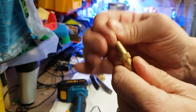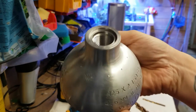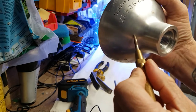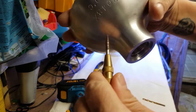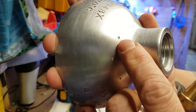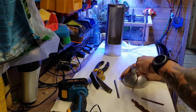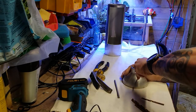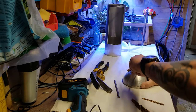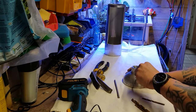A little punching device here — as you push it down I'll show you. I've pre-marked the holes where I want them to go. You've got six there. So basically you grab all of these things and they'll give you a bit of a pilot hole for your drill to go. So you push and they suddenly give and they'll punch a nice little pilot hole ready to go. I've done it once, then you just go around a couple of times clicking them in. That'll just make a nice little hole so you can make sure your holes are all nicely drilled.